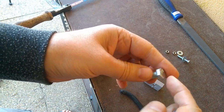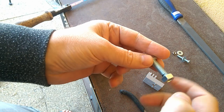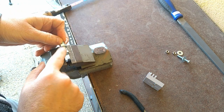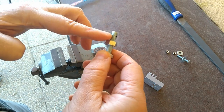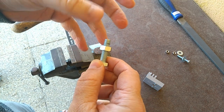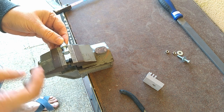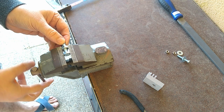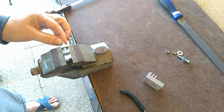I will start with the M8 screw with the hexagonal head, and all I need is another nut. It has two functions: first, it stabilizes the position in the vise, and second, at the end we always damage the thread a little bit, and when we remove the nut it will fix the end of the thread. The head of the screw will fix the screw in the vise and prevent rotation on its axis, and the nut gives additional stabilization.